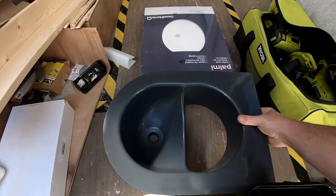First thing we need to do is look at the instructions. These are available in two sizes — a slightly smaller 5 litre version, but we went for the bigger one. We're going to need a 47 centimeter by 37 centimeter flat piece of wood for the top. We've got plenty — we can work with either MDF or plywood. There are also wooden slats at 24 by 48 millimeters; B&Q had ones at 27 by 44, not quite the same but good enough. They say one and a half meters needed — we've got nearly 10, so we'll be alright.